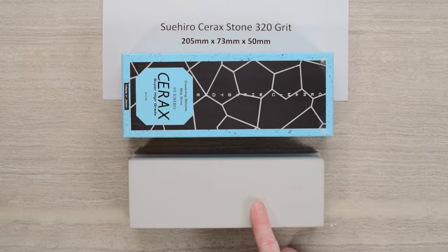It's probably just a touch smoother feel than the Shapton pro, though they're pretty close. It's fairly hard but creates a fair amount of mud, so this might be good for doing some thinning where you need to follow a little bit of a contour. It's definitely not in the same category of hardness and no-mud like the Shapton glass 320, which generates no mud and is a very hard, precise stone. But it did sharpen quickly with nice feedback and feel. It's very tall, so you get a lot of use out of it — good value.